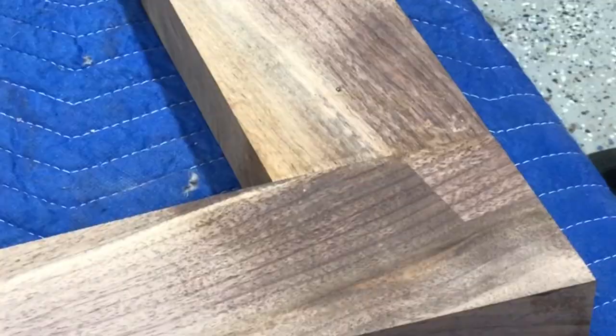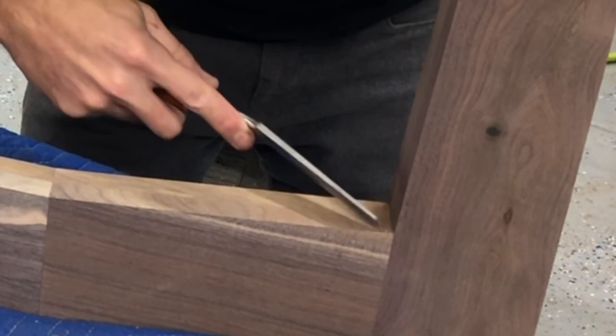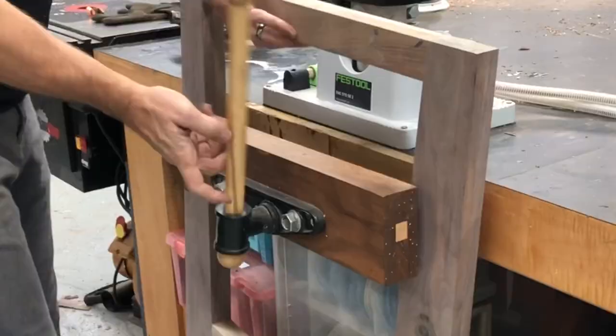You can see there is my repaired spot. As I mentioned, if you know where to look, you can definitely see it, but overall it was a pretty good solution. Getting the glue joint out of the corners without really gouging into your piece can be a frustrating, tough task, and this kind of bent neck chisel that I have there is a really good tool for getting those corners out.